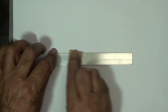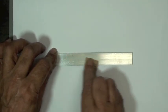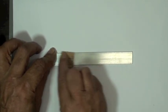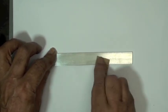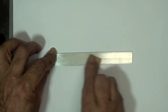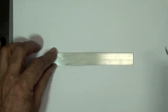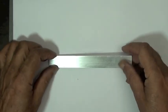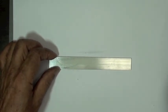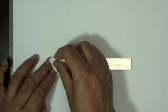As he's preparing the surface, he's preparing an area that's actually larger than he needs. We start large and get progressively smaller, so we don't drag contaminants into the gauge location later. And we don't want to over abrade it. We're going to do three abrasive steps. The next step is going to be a wet abrasive using Micromeasurements M-Prep Conditioner A.